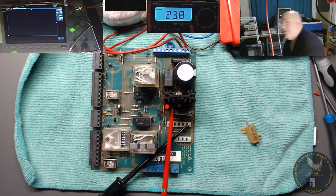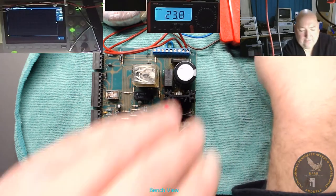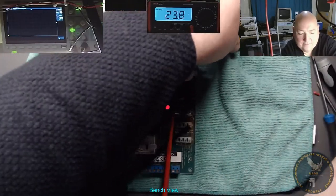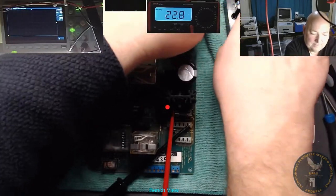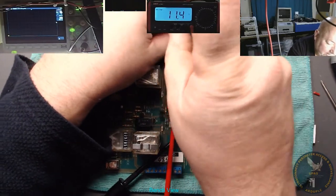Some kind of dummy load, I think, adjustable load for the future. I used to use a bulb. Anyway, I think we'll have a look under the microscope next, see if we can see any movement. That's probably the best thing. Right, so you've got voltage. I can't find an intermittent fault without really a load being drawn, so that's out of the question. I'll get rid of the power, get set up to use the microscope.